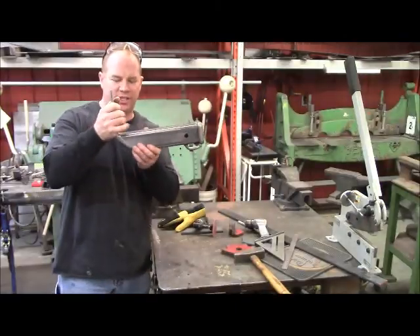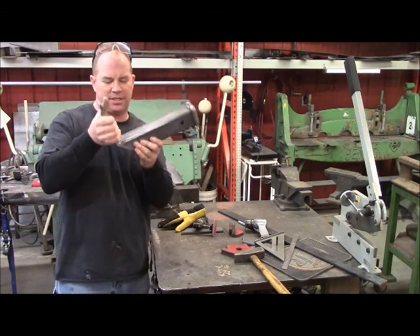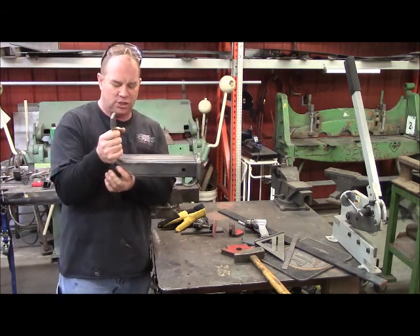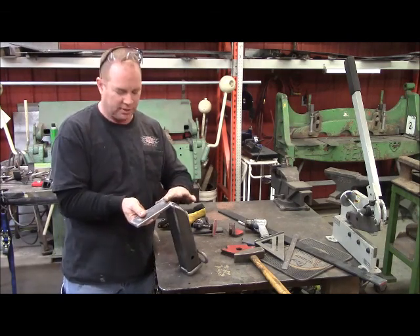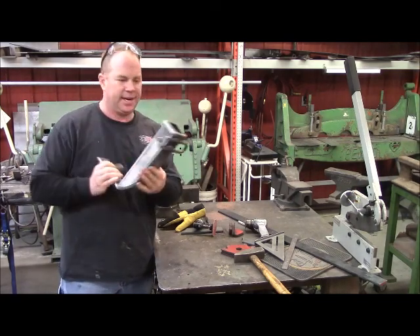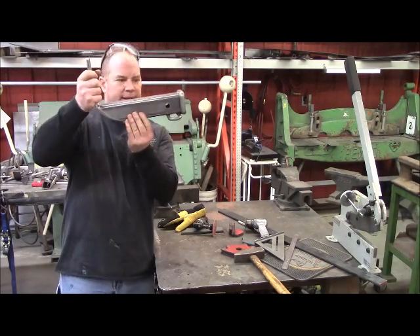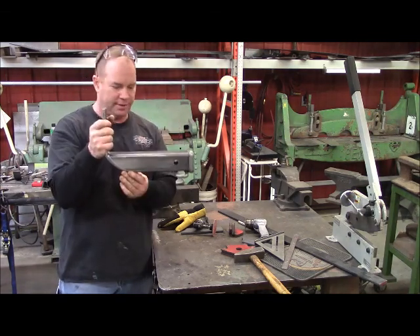Alright Bruce, here's your custom hitch all welded up — looks real good. Going to have that nice little ramp on there, and that serves two purposes. It strengthens the way I've installed this because I have really no weld right here, so it's going to let this flex a little bit. I've got your safety chain on there and it looks good too. Now I've just got to get it up in there, weld it, and start building a frame around it.